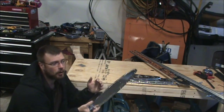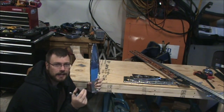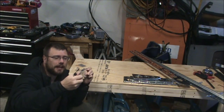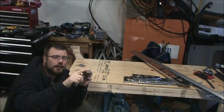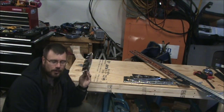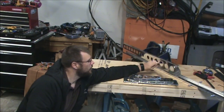So when you have bending forces on it, most of the stress or compression is showing up in that flange. The center section of it really isn't doing that much. And that's part of the reason you can have the lightning holes in it, because all the forces that you're seeing are out here. If you want me to, I could do a video on that where I break out the statics book and actually show you how the forces work inside of a beam, which is basically what your spars are.